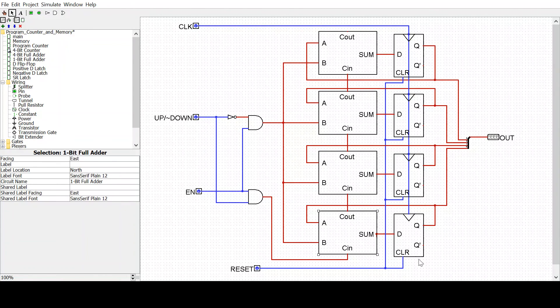The least significant bit will change to 1. Now, on the next clock pulse, this output is 1. So now we have A as 1 and still carry in as 1, if we're still enabled and counting up. A is 1, carry in is 1, we add that, we get 0. This changes to 0, but now the carry out here is 1, so that goes into this and becomes 1 on the next clock pulse. So we have 0, 0, 1, 0. Similarly, on the next one, A is 0 now, but carry in is still 1, so this changes to 1. So now we have 0, 0, 1, 1. We're counting up every clock pulse. This functions as a counter when enable is high and when up is high.